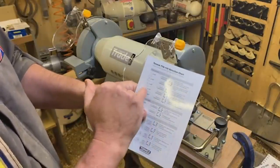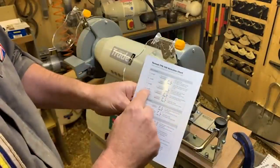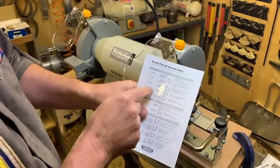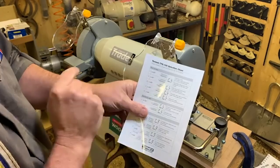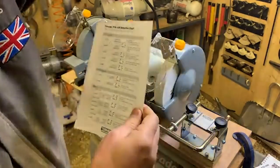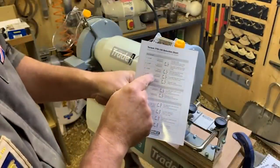Yeah. So it's recipe number four. So we've got five here. Recipe number four. That gives me a back angle of 55 degrees. The back angle to the gouge there. Getting a bit of light on it. Bit too much light. Let me get rid of that. How's that? Better? So it gives me a back angle of 55 degrees.